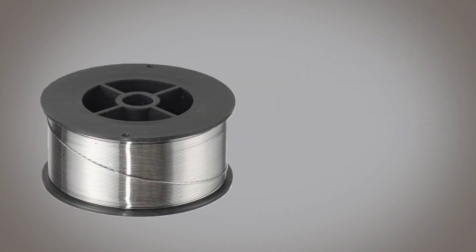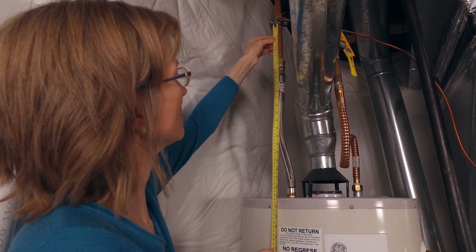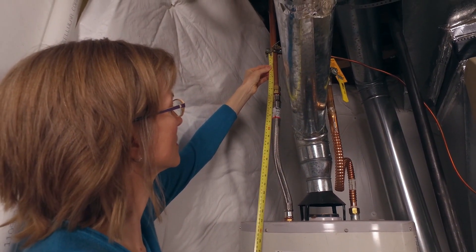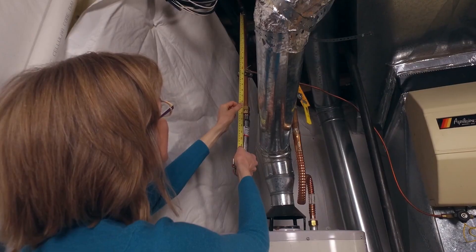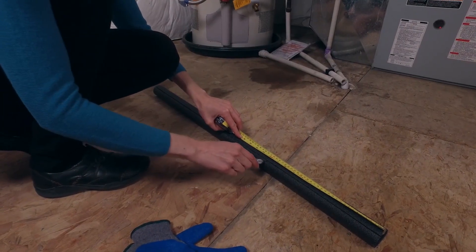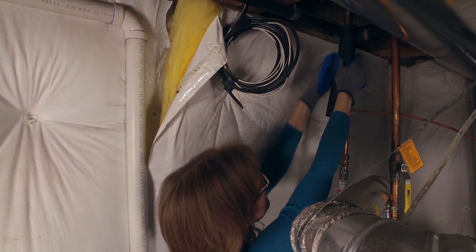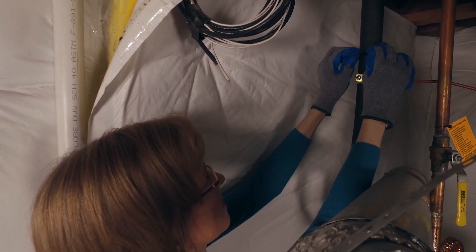You can use either wire or aluminum foil tape to secure it to the pipe. Starting at the water heater, measure out the insulation needed to cover all accessible hot water pipes, especially the first 3 feet of pipe from the water heater. It's also a good idea to insulate the cold water inlet pipes for the first 3 feet. Cut the insulation to the necessary lengths, place the sleeve on the top of the pipe with the seam down, then tape, wire, or use a cable tie to secure the sleeve every foot or two.